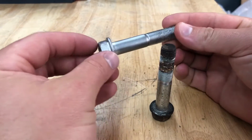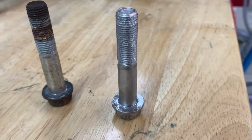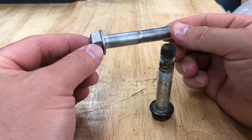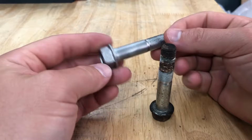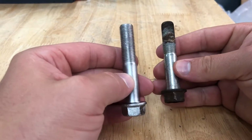So that's why I've always liked this, but it's also a good coating prep process as well. I have been told many times over, for zinc plating, the vapor honing prep process is fantastic, because now you're ready to go ahead and coat and treat this part. And it looks incredible. The finishes are amazing. The rust cleaning capabilities here are phenomenal.